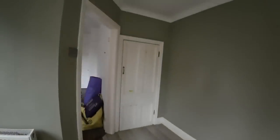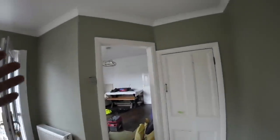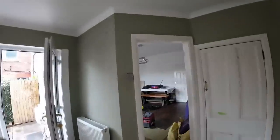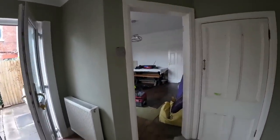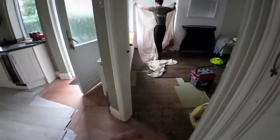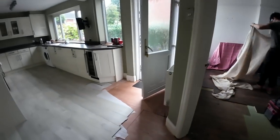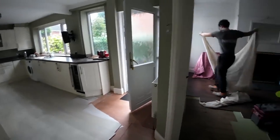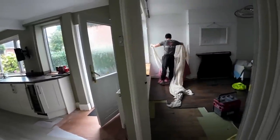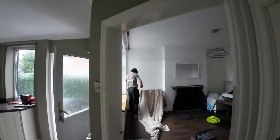Because, obviously, structural engineers have to make assumptions. So it's on our drawing to make sure, check everything that is assumed before we go ahead. Make sure everything's correct. So, timber floor, so we're going to have to take the floor up to prop through, unless we can find a joist to prop off, which will be on a sleeper wall underneath. So I'm sure I can cut all this waffle down. So let's start taking things apart.